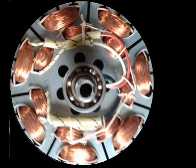Forgetting about the coils on the inside for now, we notice that there are only seven coils on the outside. Seven is an odd number. Magnets have two poles — that's an even number. What you're looking at is fourteen poles on the outside: seven poles where the coils are, and seven where the stator lobes are between the coils.